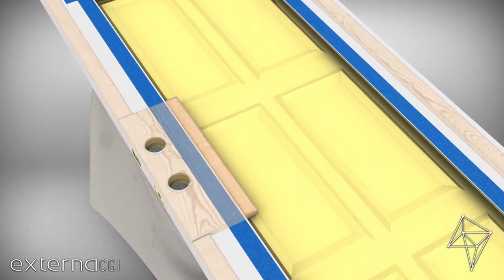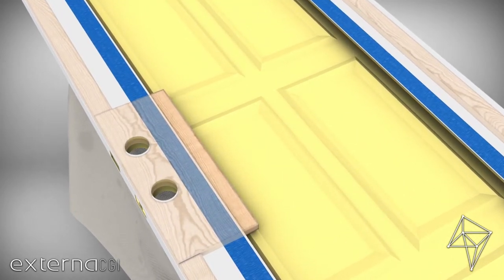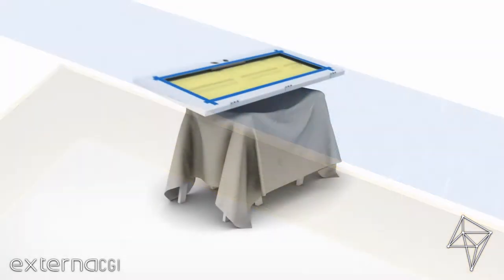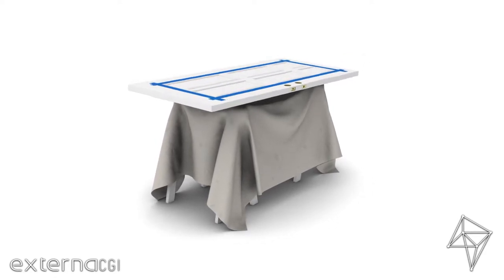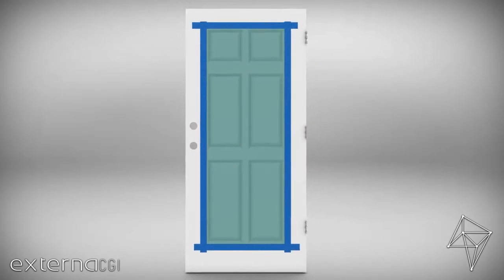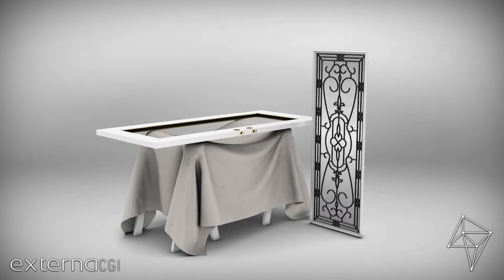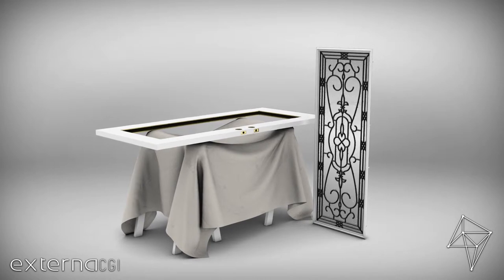Because you'll be cutting through a material of different density near the lock, you will feel slightly more resistance. The newly cut edges of the door are sharp, so be sure to wear gloves. Carefully flip the door over and repeat the same steps, making sure your cut lines are the same distance from the edge of the door. Next, remove all tape and debris as well as the cutout portion of the door. Now you are ready to install your new ODL door glass.